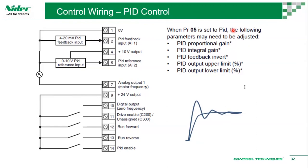Digital input is 4 only. Yes, we have 4, but your digital input can be switched into another digital input. Analog input 2 can be switched into a digital input. Our analog digital output is configurable to become an input as well. So that gives you about 5-6 inputs.